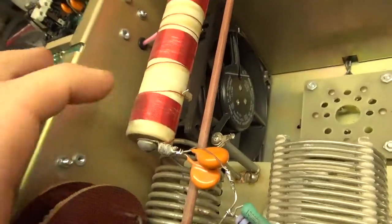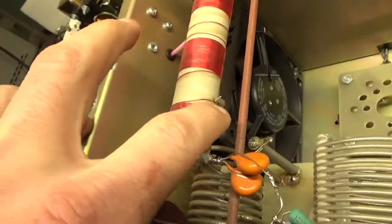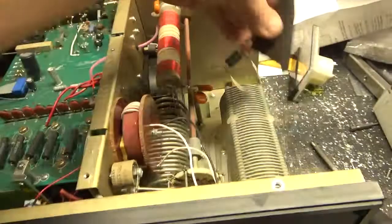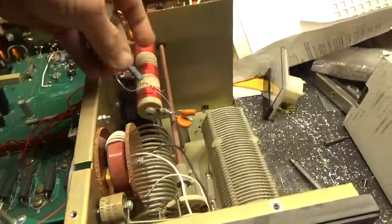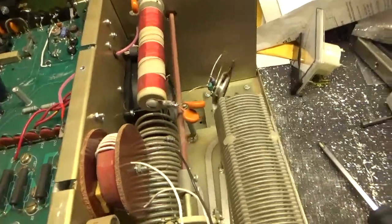Plate choke had opened up, twisted it, so I'm going to change the plate choke. See how the wires twisted there. They added some sort of parasitic setup — I'm going to replace it with the proper setup from Ameritron.